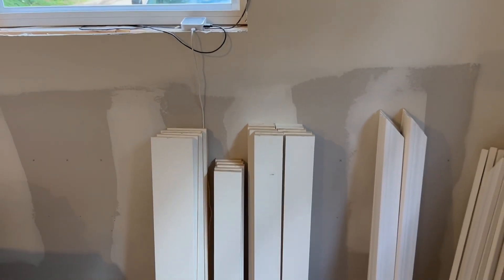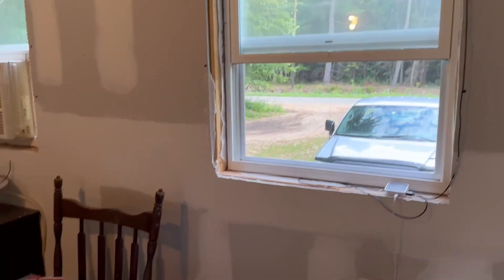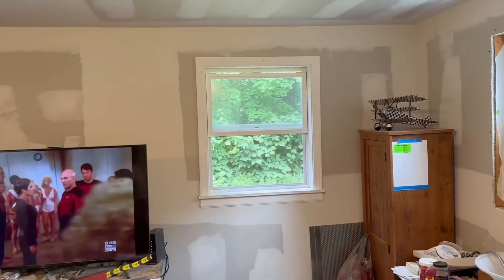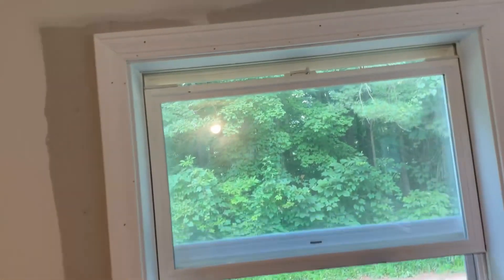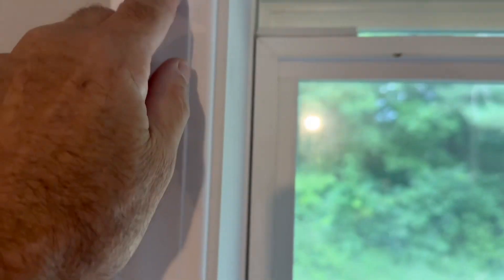What's neat is we assemble these first. You don't take each piece and put it up on the window individually — we assemble it literally on the ground. We assembled it fully on the ground, casing and all, and then placed it into the opening, just like putting up a picture. And it was that easy. Then these outer nails — 16 gauge — hold the whole unit in place. I put literally three in each side, three across the top, and three on the other side. That way you don't have to put any nails on the jam whatsoever.